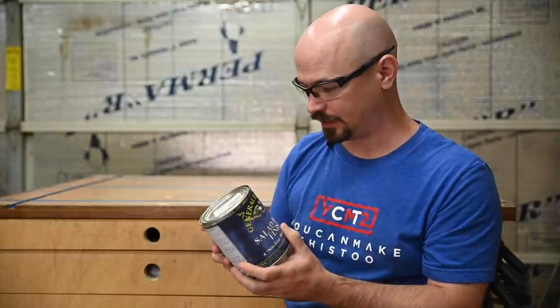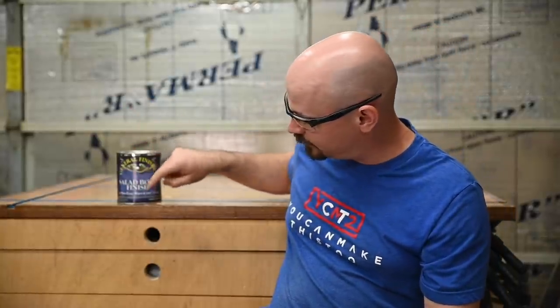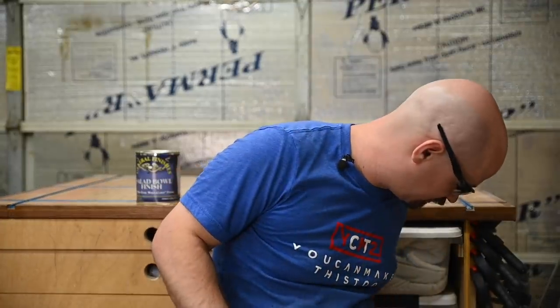But there's been several guys who've done some really elegant articles that have dug into section 175 and looked at this statement. And what they concluded is that pretty much every component used in common wood finishes, including the metallic dryers and solvents, etc., in unpigmented finishes, that's a caveat, are on that okay list. So the stuff in this, when cured, it's safe. They're all on the okay list, just like this stuff.